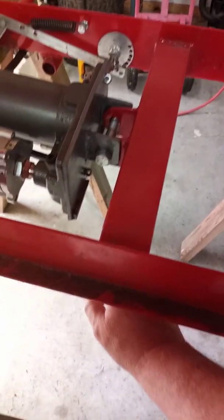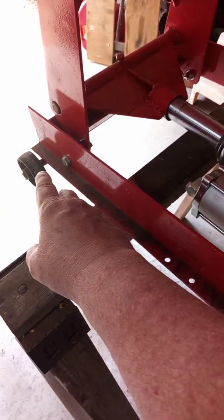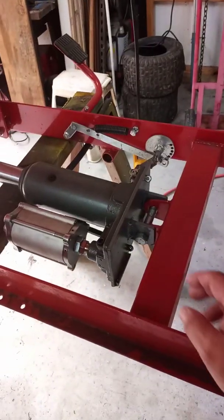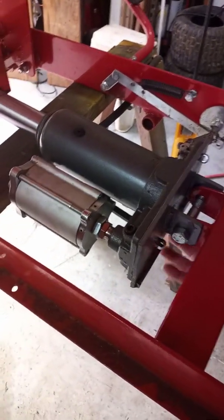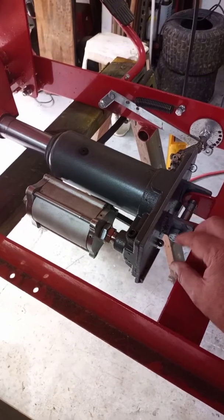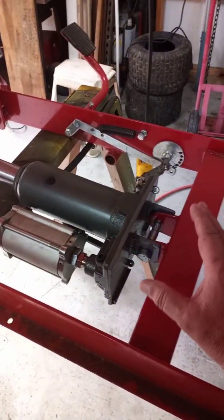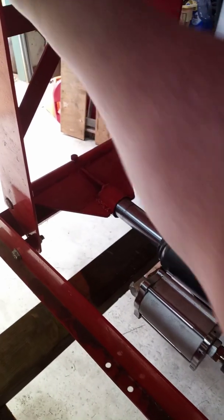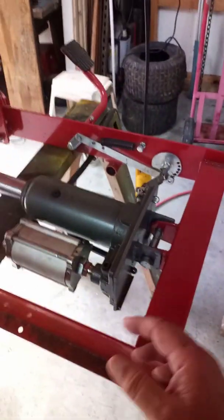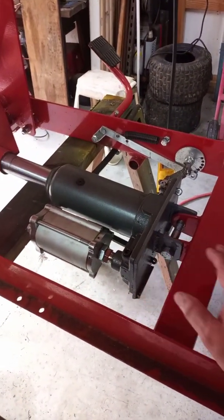Before I started mine, I've seen some where people would put the jack in and it would be down too low, and they would have to raise the wheels up on the front of the lift. And there's nothing wrong with that. That's not knocking the way anybody did theirs, but I didn't want to do mine like that. I laid a board in under my jack before I even started trying to mock it up, and held it up 3/4 inch, I believe, off the plywood that I had laying under here. That way I was able to let this down and see that it was not hitting, and also it was up off the floor too. There's not a whole lot of room to play with there.